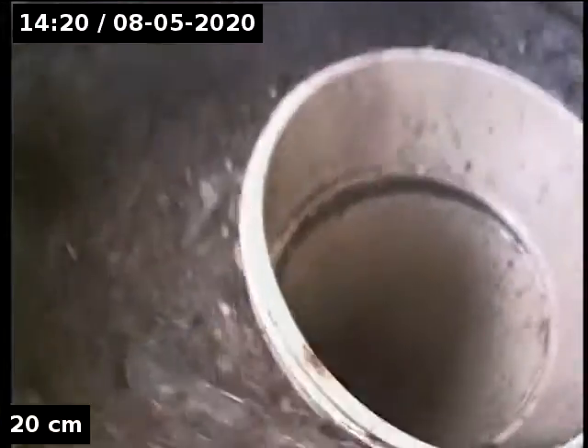Got a bit of sediment at the bottom. We're going back down. This is about 1900mm deep — nearly two meters to the lead-off. It's pretty solid, whatever that thing is coming through. It's like a bit of stick or something, I think. Around the trap.